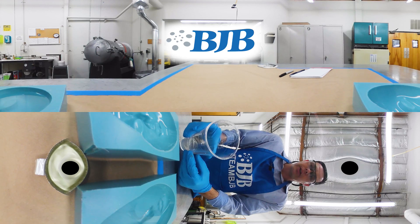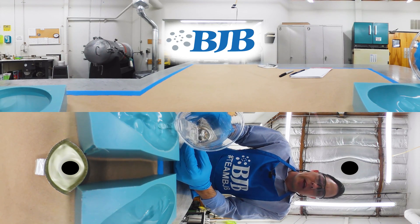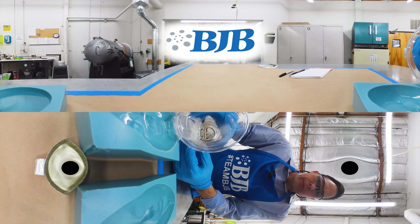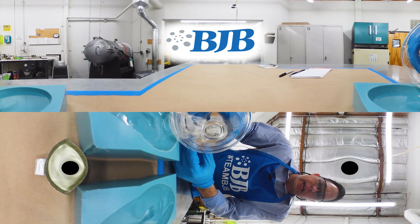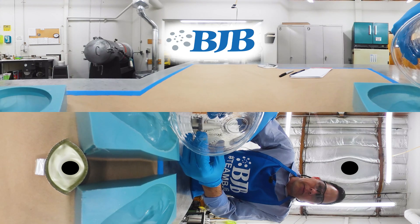On this last pour, this mixture has literally just been mixed in the cup and not degassed. We're going to show the difference between a pour that has been vacuum degassed properly and one that has had no vacuum degassing — and you'll see the huge difference in the amount of air trapped in the materials.